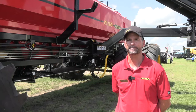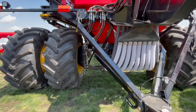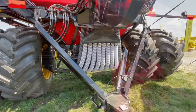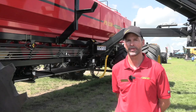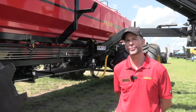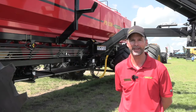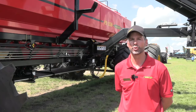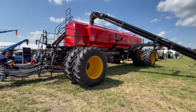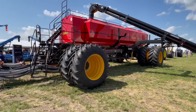Let's talk about some of the other features. I see high flotation tires and dual tires — big features. Some things our customers have been asking for that we're very excited to announce on the 1350. One thing customers will notice above and beyond our 1,000 bushel tank is we have 900 duals on the rear — previously only 800 — so quite a bit more capacity on the back end. This is also our first offering of dual front wheels on the front axle, a 710 dual, for increased flotation with the higher loads.